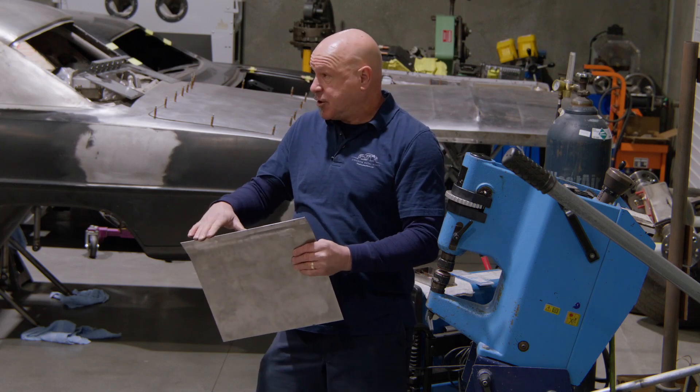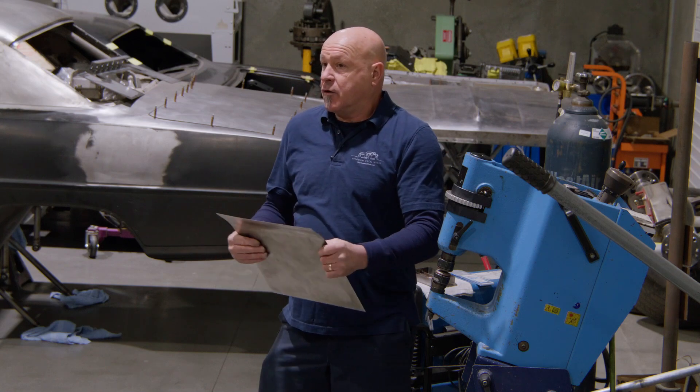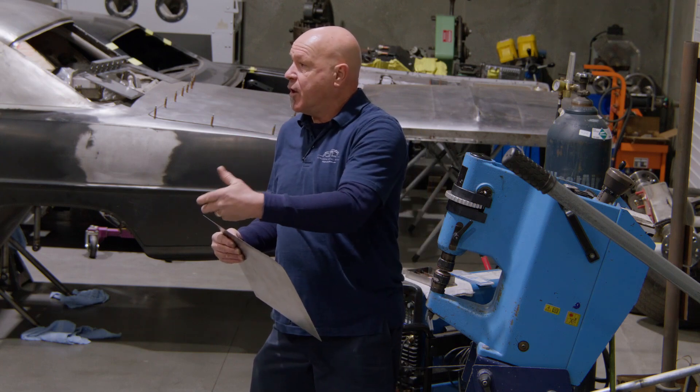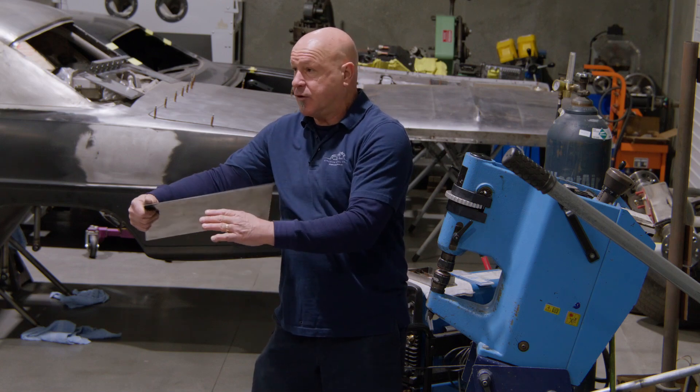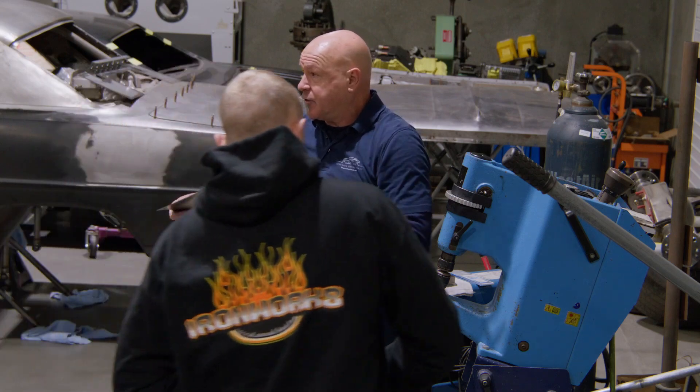When it comes to welding edges, stressed edges are difficult to weld. Gentle stretching will really help. A little trim on an unstressed edge means I can then take it into another stretched or shrunk edge and it will work out exactly the same.